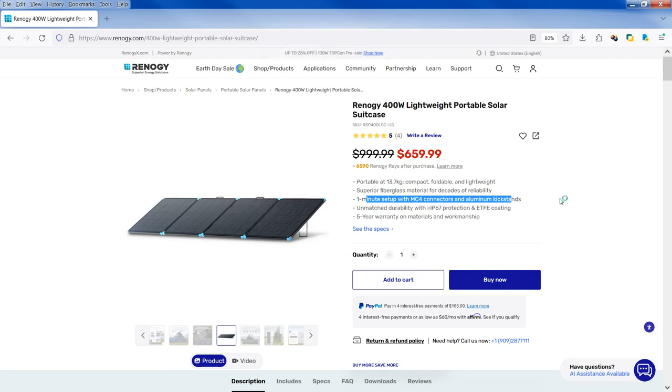Do yourself a favor. Stand in the middle of the panel, right? And then you set up the two middle, and then you go each way. Set up one on the other side. You put the center of gravity back where it belongs, and then you don't have that awkwardness of 60, 70, 80% of the weight on one side leaning, and that always tips it over. So stand in the middle, set up the two legs in the middle, and then work your way outwards from either side. Just lean one way and do one leg, and then it's much, much easier to set these panels up.